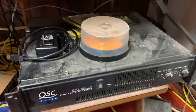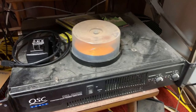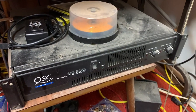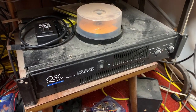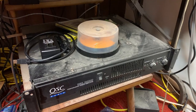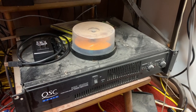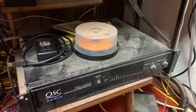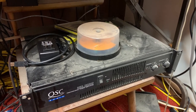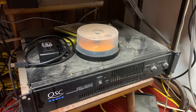But yeah, you need to have some kind of signal processing, at least a very basic high-pass filter. Now, what high-pass filter would I recommend for such things? Well, Wolfhorn SDX, the new one on the bottom, that one's at its best with a 14.5 hertz high pass at 48 decibels per octave. That'll let you put up to about maybe 600 watts into it without the drivers bottoming out. But that's really pushing it. Just build another one if you want any more than 120-something decibels at 1 meter.